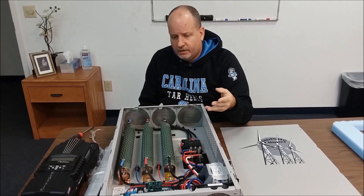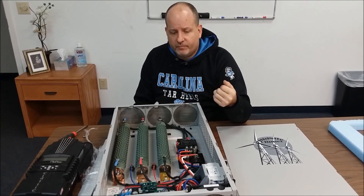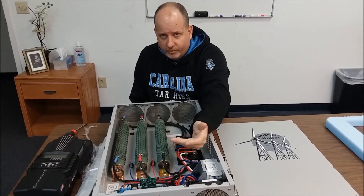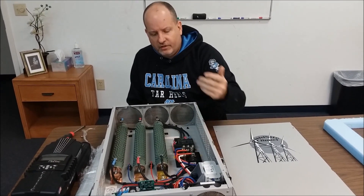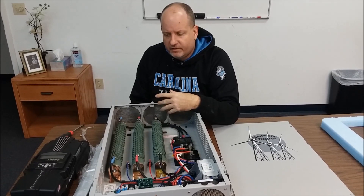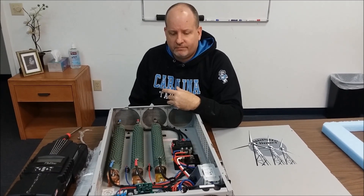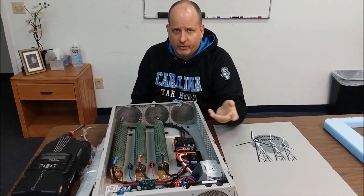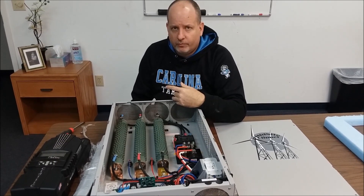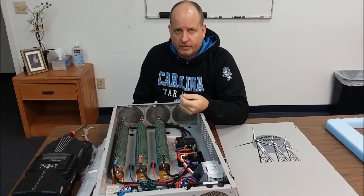...buy the nice controller that will exponentially yield how much power you make over time. You want to protect that investment and use a proper device. I'm reinforcing this because I see on YouTube guys just using the three-phase relay on the auxiliary, and as long as the Classic stays powered up you may be okay for a period of time — but sooner or later things happen. There are ground faults, different reasons breakers may trip. If you own a house, sometimes breakers just trip, and if that happens our high-voltage wind turbine will put out 300 to 400 VDC in a good wind. In that instance you're going to want that third layer of protection.